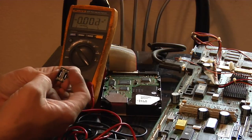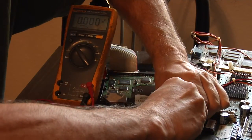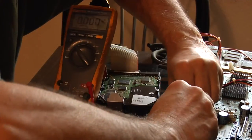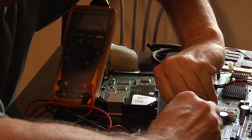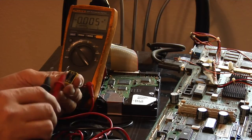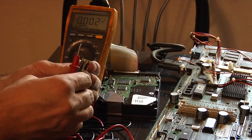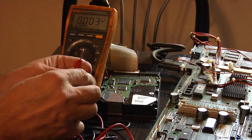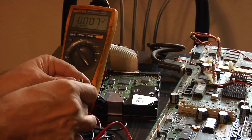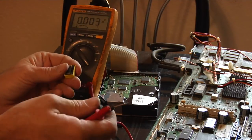So let's pop off the battery on our new board here. We're going to go to the side where the guide is — it's opposite the pin one designation, which is ground. Reading 3.114 volts — something around there. So that's going to be a good battery.